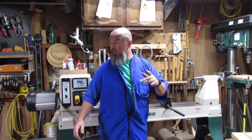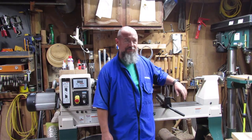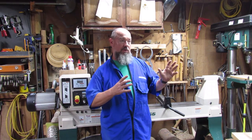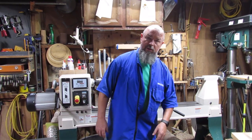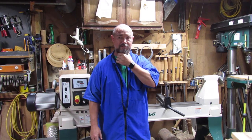But there's a couple other things that's happened. When I was cleaning up, my dust collector that I built, still working, by the way, up until yesterday, I've burned the motor up in it, so I'm going to have to find another motor. If you saw the video, I started out with a table saw motor. It was a one-horse table saw motor, and I went to a treadmill motor that I could adjust the speed and change the speed. And that worked really good for a year or more. But it burned out, and I really don't know why. I think the impeller's too big. So I'm going to rethink the top portion of that deal. I'm going to get a new motor and probably build a new impeller, a little bit smaller. I think it's just trying to move too much air, because sometimes it does pop the breaker in here after it's been running for a little while.